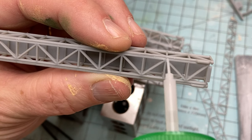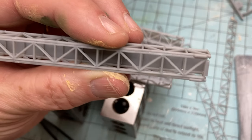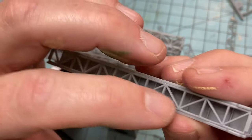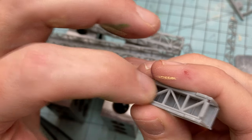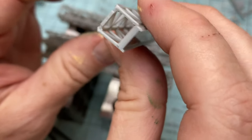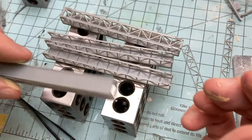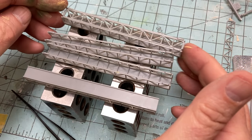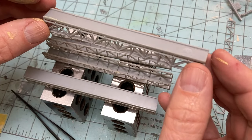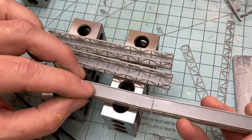It's really then a matter of gluing everything together. What I chose to do was to glue one side using my 1-2-3 blocks to keep it aligned, let that completely dry, add the second side again using the 1-2-3 blocks to keep things aligned, and then add part number 53, which is the bottom of the truss. Those are easy — once they lay on those protrusions and you line up the ends and everything looks square, just run a bead of cement and you're done.